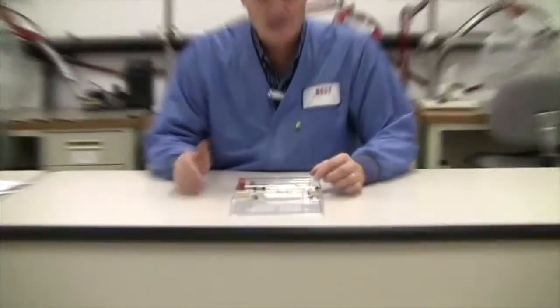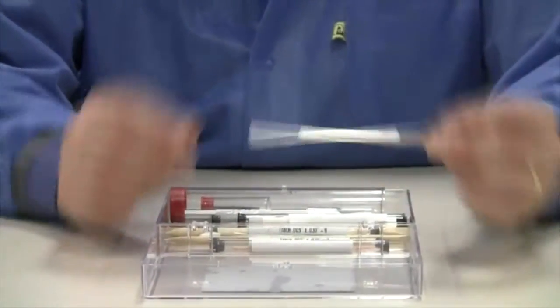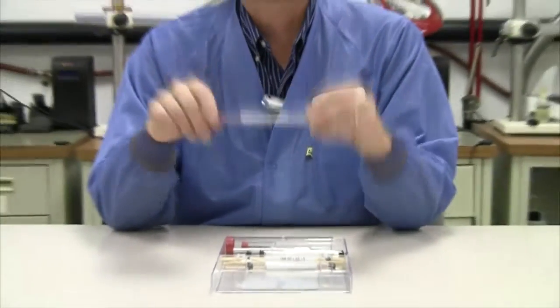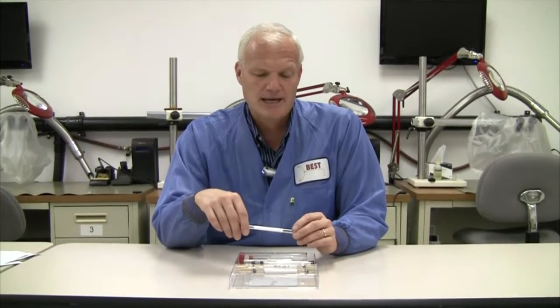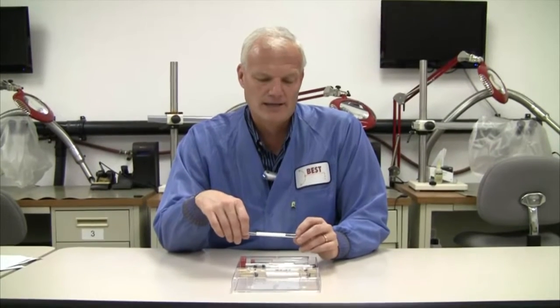The purpose of this kit is to use the epoxy method to glue down a replacement trace. Let's see what's inside here besides the epoxy that we have seen many times over. We have a variety of traces — they come five to a pack and have a variety of thicknesses. For instance, this one is three mils thick and 15 mils wide, and there are six of them in this packet.